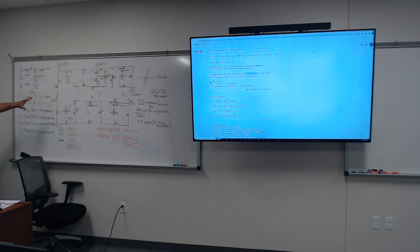All right, so I think we have everything. For the plugs, kitchen, 20 amp circuit breaker. So we got a total of 1, 2, 3, 4, 5, 6, 7. We got 7 20 amp circuit breakers. One for the master bedroom and the front exterior light. These are plugs, and we have GFCI. We got a 20 amp for the bathroom plugs, exhaust fan and lights. A 20 amp for the dining room, living room and outside plug. A 20 amp for bedrooms 1 and 2 and the hallway plug, and then we have a 20 amp circuit breaker for the laundry.